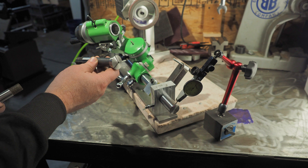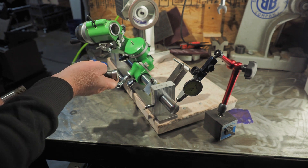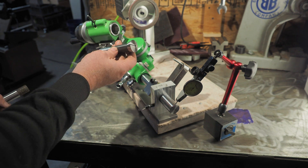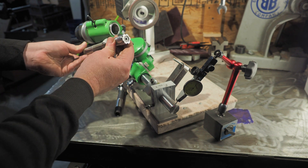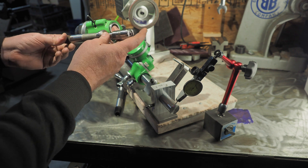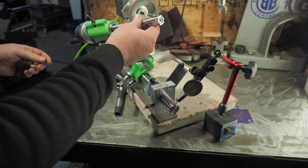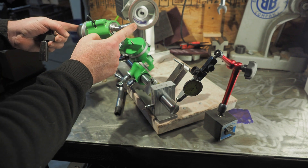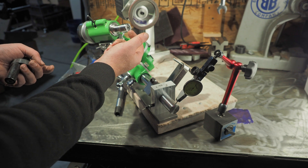One of the original ideas I had was to actually make a Morse Taper 2 adapter for this and I did actually make that. It worked okay but I found these collets on AliExpress - 8 for a set for like 80 bucks. I thought that was a good price and they turned out to be surprisingly accurate. While I don't have all the sizes, one of the things you can do is buy a decent ER32 or - this is the ER16 or ER8 - it doesn't really matter. You can pop that into one of these collets and then if you have the full collet set for the ER adapter you just pop this in here. You do lose a little bit of distance because of the shank of the collet but what you gain is the accuracy of these ER collets for off sizes.